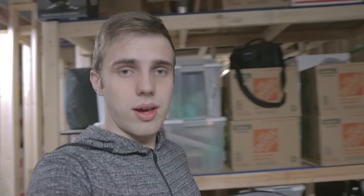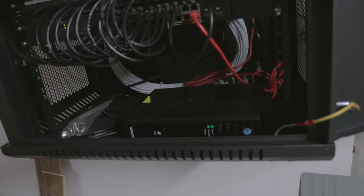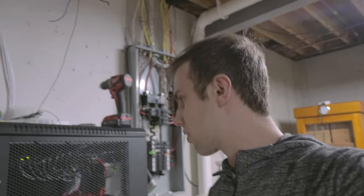My fingers hurt and I want to go home. We got the first patch panel installed in the rack. We put the AT&T router in here and checked the access point upstairs — it's working. He wanted rack power, so we're going to use a UPS but need to replace the batteries. The rack will have the router, two patch panels, and the UPS. Part two is going to be installing security cameras, a Dream Machine Pro, and the other access points. Everything should be done at the end of tomorrow.